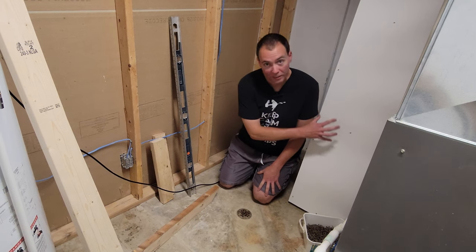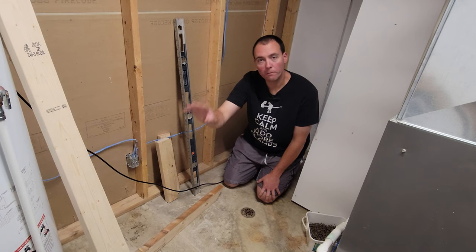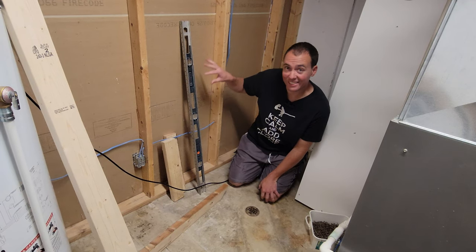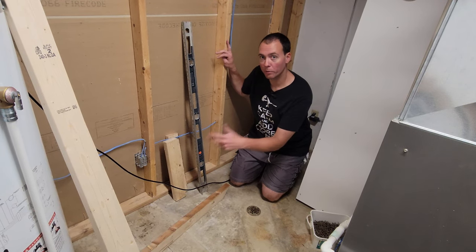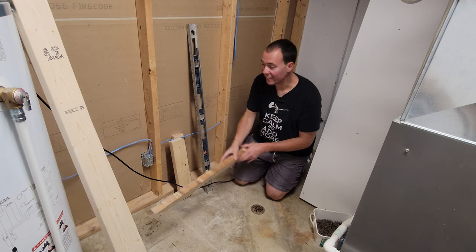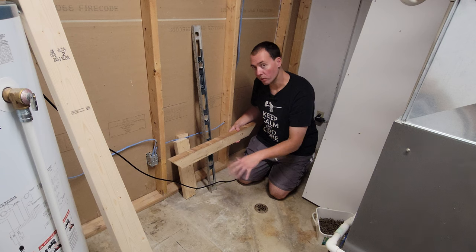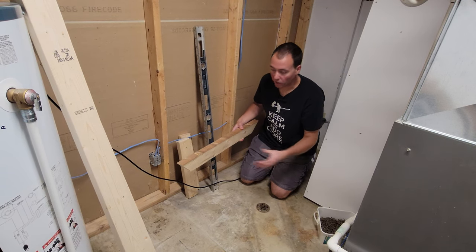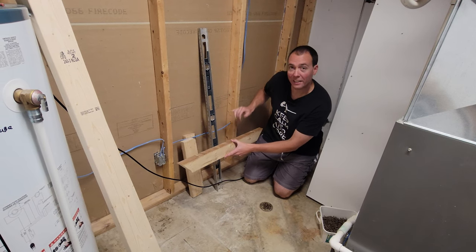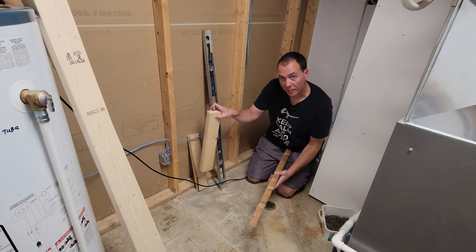Here we are inside. We have the three completed shelves, and over here I have two 2x4x8s — these are going to be the front support legs, one in this corner and one in that corner. To attach these shelves, we're going to be using the existing stud wall back here, just driving in 3-inch screws through the shelf into the studs. I've got this scrap board — I'm first going to attach it to the wall at our 18-inch mark, because the spacing is going to be 18 inches between each shelf to make room for totes. I'll attach one screw, use my level, attach the next screw, and that'll allow us to rest the shelf on this 2x4.